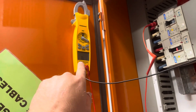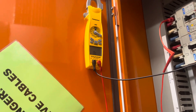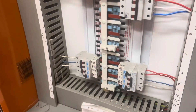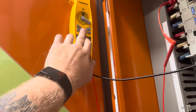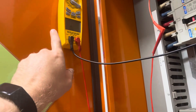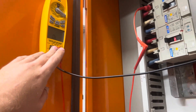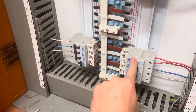I'm intermittently getting a reading with those three off — there we go, it's come back on. I've flicked my multimeter over to ohms and taken it off the tone function, because I think that only works up to about 50 ohms or something like that. I wanted to see what kind of readings I was actually getting. From what I can tell, if I turn these two on, there's a direct short.